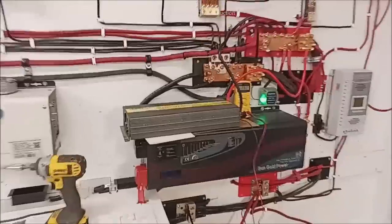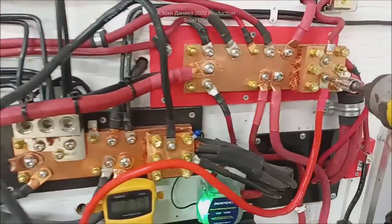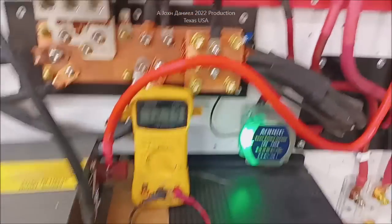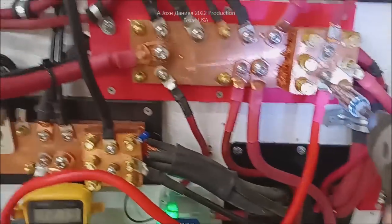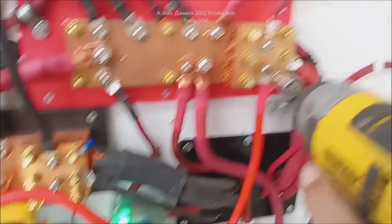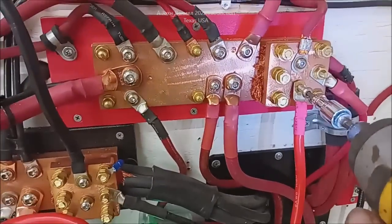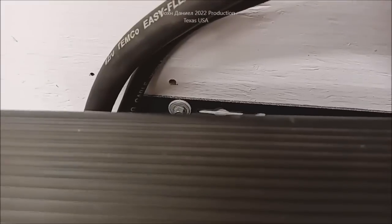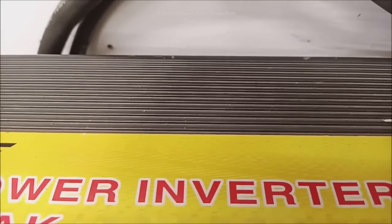Turn that air conditioner off so you can physically hear it. I'm taking the connection loose — that's its power. There's the bottom bank running at 12.79 volts. As soon as this bank up here drops below 12.8 that'll disconnect from the bottom bank parasitically. Now I'll take this loose — listen to that. Those are the capacitors draining down. They're dying.